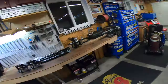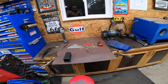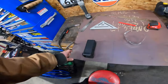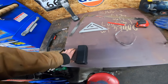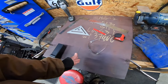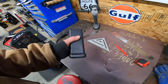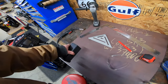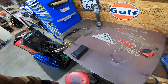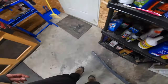Basically what we're doing is taking a 30 by 30 sheet of 3/16 steel and cutting out a couple of plates. Our top plate is going to be 14 by 8 inches, and then our bottom plates are going to be 6 by 8 and 6 by 8, because there is a beam down the middle of the trailer and I want this to be centered. I'm going to take this two-inch receiver and make a bracket and weld it to that top plate, then take this L-channel and cut up the pieces I need.